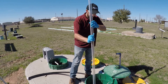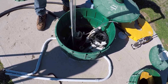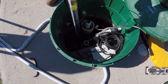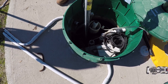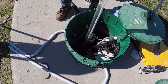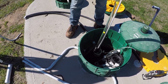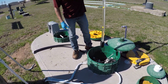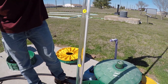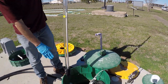One of the first things I want to do is check the pump tank for any solids, just to make sure it's clear. Sometimes we'll end up with solids in the pump tank — it could be for a variety of reasons. Maybe the tank hasn't been pumped out in a long time, or a lot of the times it's because there's a high water usage event — a high flow of water in a short period of time that can carry the solids over. You can see in our sludge sampler here that it's clear. This is what we want to see in our pump tank. We don't want any solids.